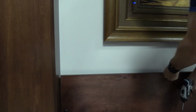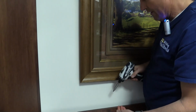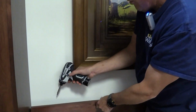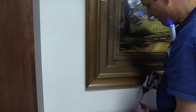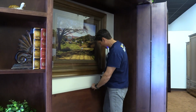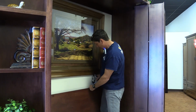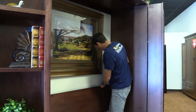Now, back here, there are holes for these hinges, and this is where you run these 5/8 inch wood screws right down into those holes, and you're essentially screwing that right into the top of that old headboard that won't be used anymore. So I'll just go ahead and run those screws in. Just going to get all these screws in all the way across this headboard.